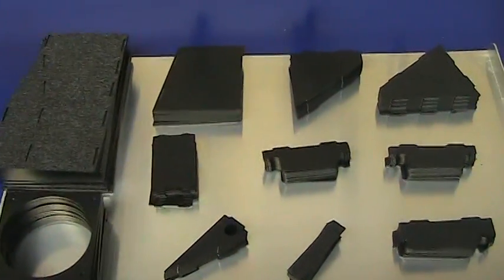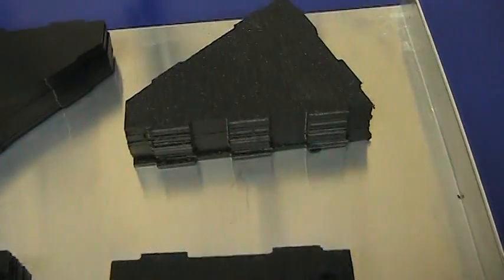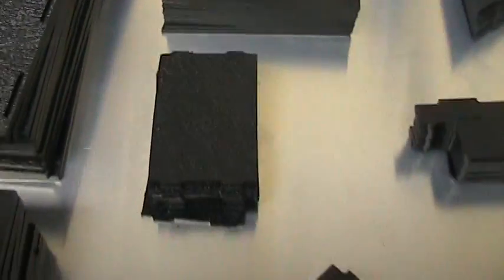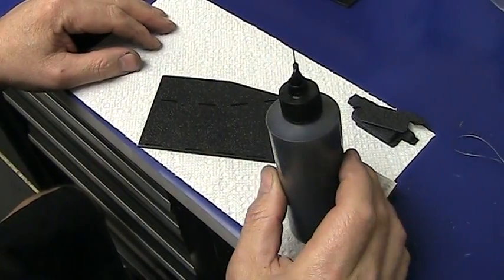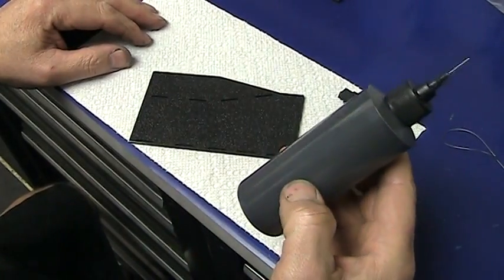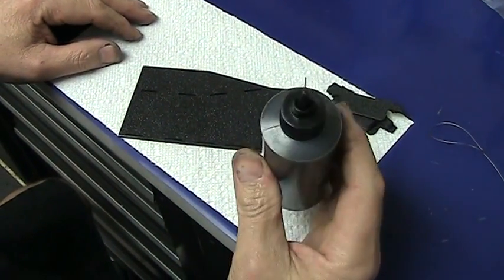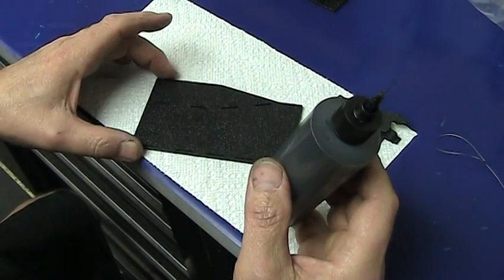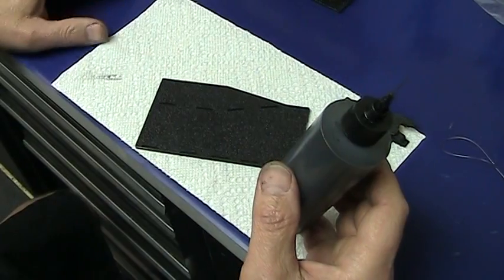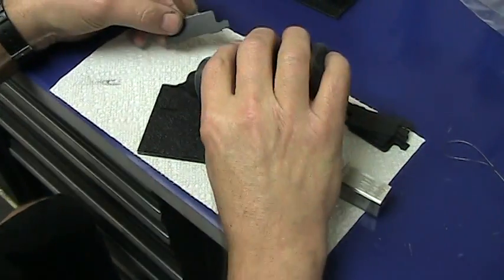Here are all the parts for 12 boxes. They all have their tabs ready to assemble. We're bonding material together with MEK. I gathered up a bunch of chips from the milling operations and put them in to give it a little body and to make it black. But really, the MEK by itself works just fine on the ABS.